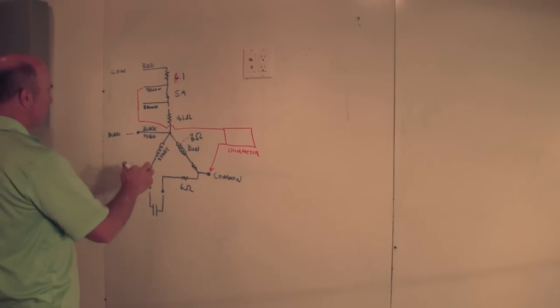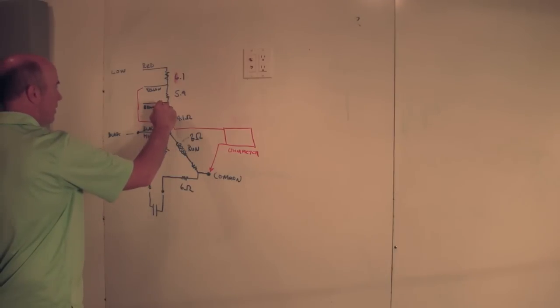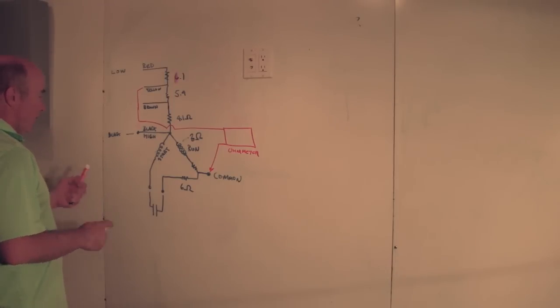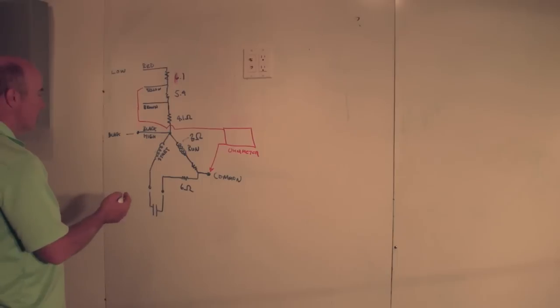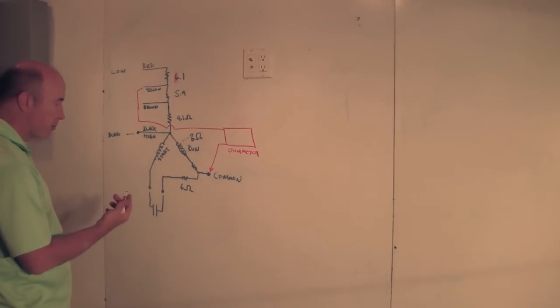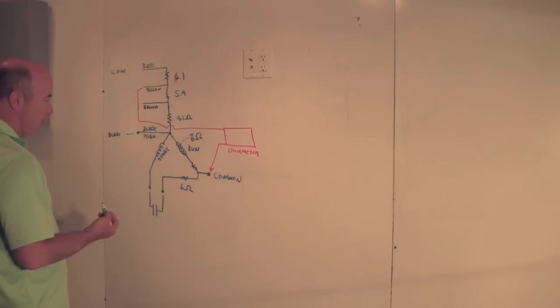And then I had some weird things going on, like this was connected down here. So you'll see that. I'm going to put it on a bench in a minute. We'll measure these. The other thing, the two wires that come out of the motor for the capacitor, sometimes they're color-coded like a solid color, maybe a brown with a white stripe. Mine happened to be purple. There was no white stripe.